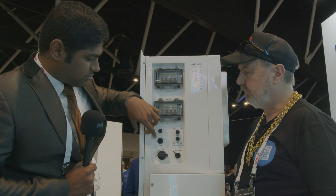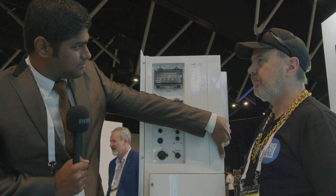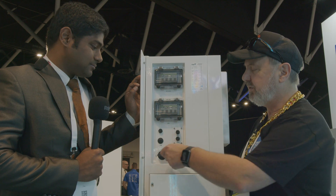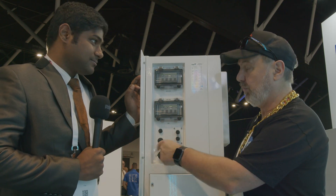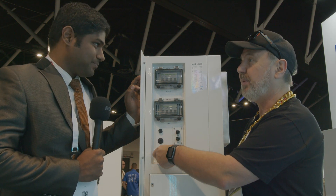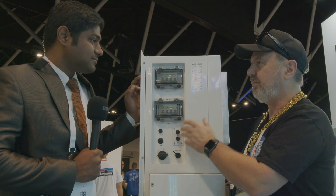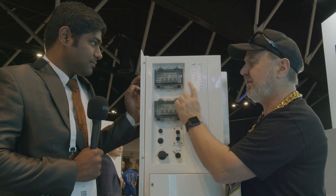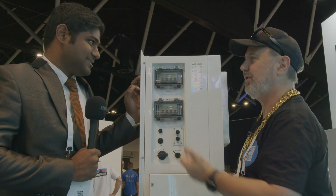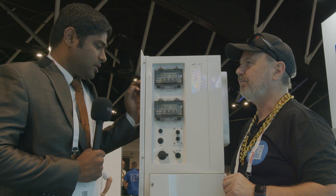There's a DRM com port and a general Wi-Fi port, a USB port for software upgrades, and ethernet ports behind the panel for wired internet connections. From a standards perspective, there's an integrated DC isolator for the PV. On the AC side you can shut off both the grid side and the EPS side — it's a lockable enclosure with circuit-breaking capability.